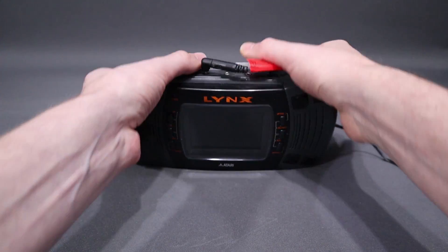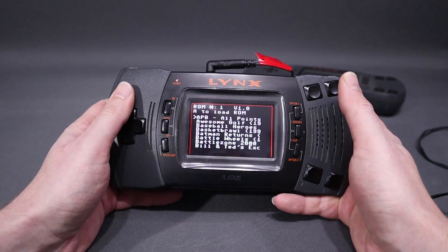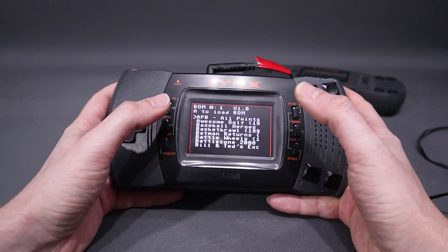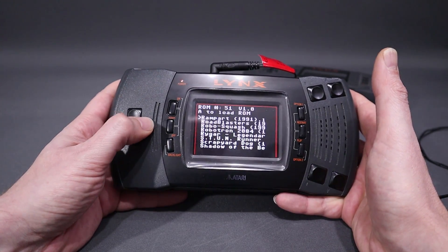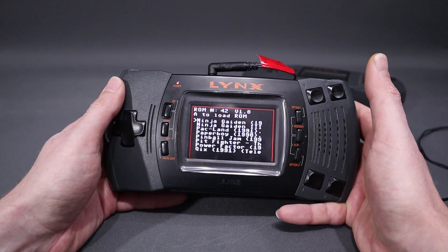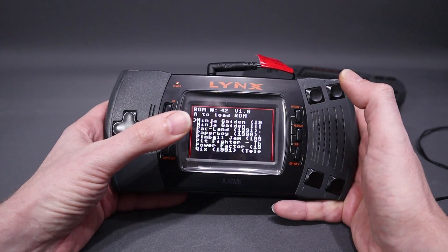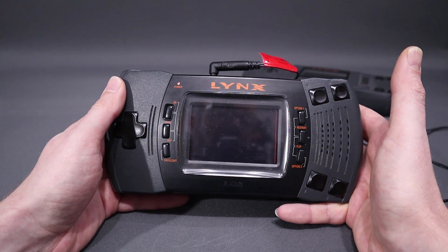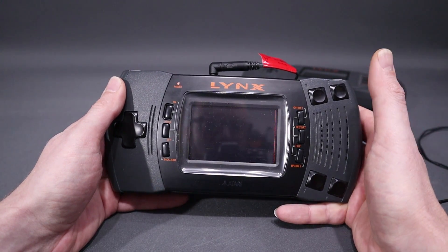That simply goes in here and we turn it on and we get our menu. Now Ben has got this to the point where it works. There's nothing fancy about it whatsoever, but we can show that it works. One of the big things he's put a lot of work into is getting the load times right down — basically where it transfers the ROM into the SRAM — and if I hit go, that is less than a second, which is really impressive for a flash cart.